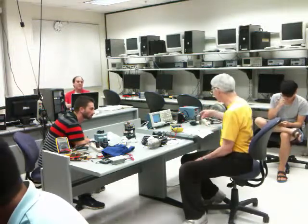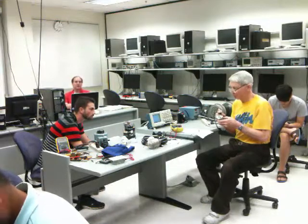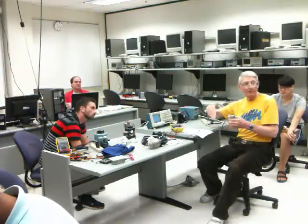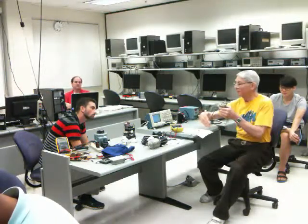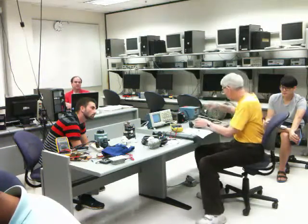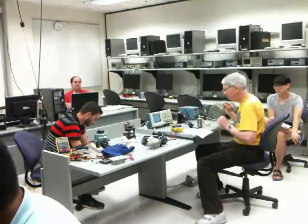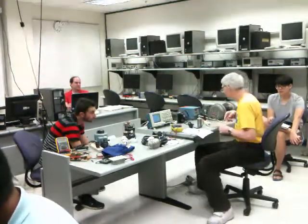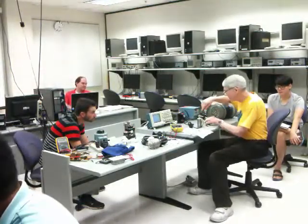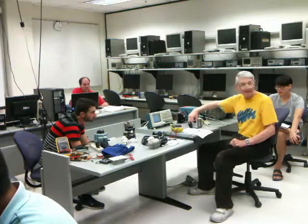If I put in this 40, it'll be too big. Instead of getting 0, which is what the lamp will get, and instead of lagging, which is what the fan will do by itself, it would lead a little bit, wouldn't it? It's too big. Try it. I'll plug it in, because wires are exposed. Which is what I calculated. So there's lagging. Plug this in, it should be slightly leading.